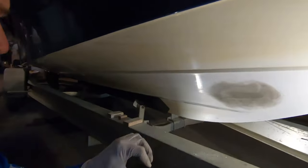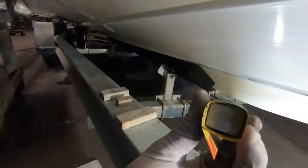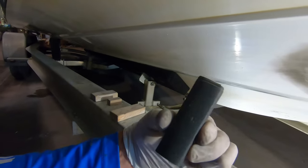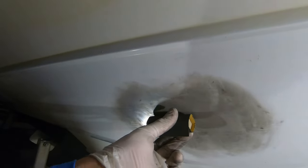At this point we are probably ready to put some sandpaper around a block — probably some 220 or 320 is typically what I start off with. The nicer your boat is, maybe you go to 400 immediately, then 600 and 800. The block I have here is about three-quarters of an inch square by about two and a half inches — it's the right size for this repair area. You don't want a block that's too big or too small: too small and it won't level the surface; too big and you're sanding areas you don't need to be.